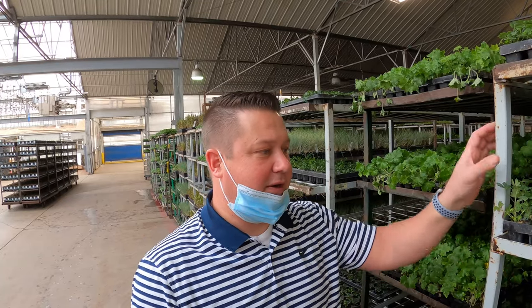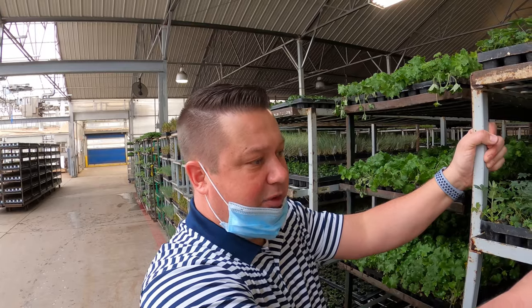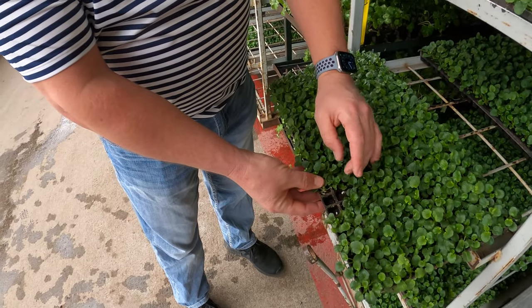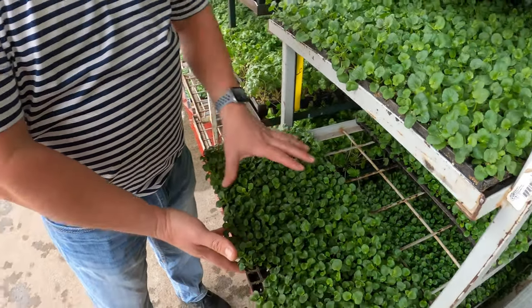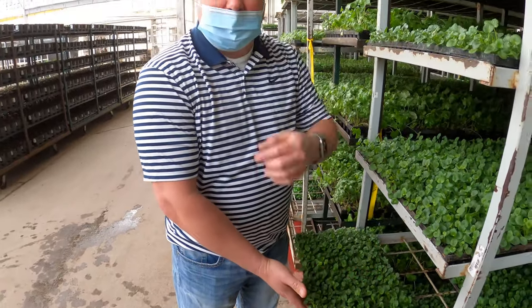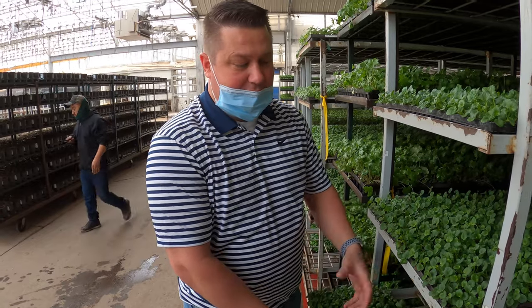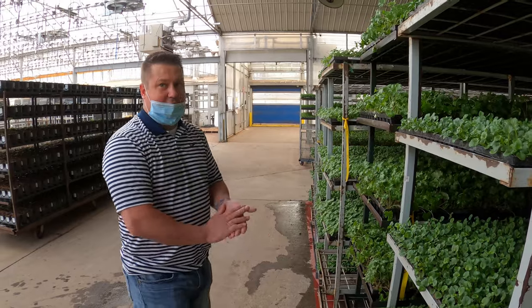The machine will go into a donor tray, pick up one plug and plug it in there. The whole purpose is so you can run these through a machine and not have to have somebody at the end filling in missed spots. When you transplant into the final pot, you want every cell to have a plant. These three never germinated, so we'll manually come and transplant the whole tray into the finish pack, and somebody at the end will stand there with a donor tray and plant them in. The machine does most of the work and then we fill in the gaps.